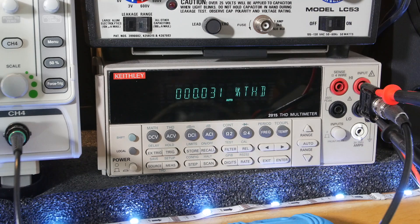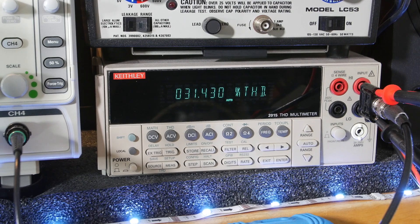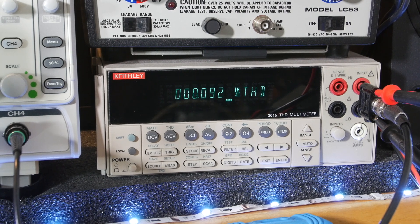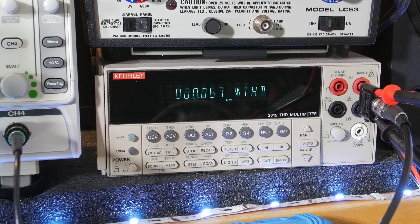You can see 0.03%. Now let me go down and change the amplitude — I'm going to go to 2 volts, and then you just have to wait for it to settle in. Some of these kind of bounce around; it goes all the way from 0.06 to 0.09, 0.1 sometimes. The THD plus noise takes a little bit to settle in and does bounce around because it's reading a bunch of noise.